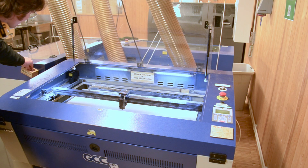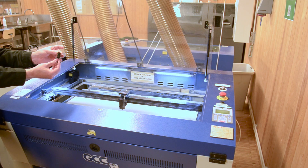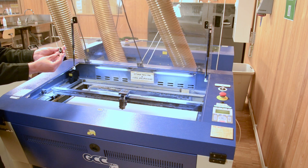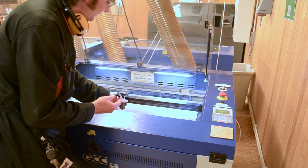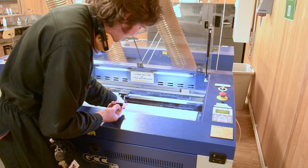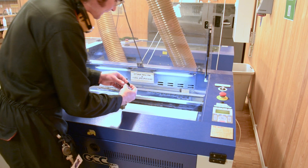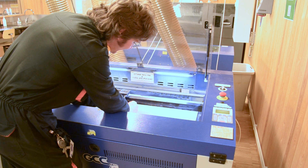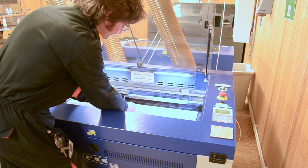Make sure that you fetch the focus pin. These are very valuable — they cost a lot to replace and are very susceptible to damage if dropped from holding height, so handle them carefully. Do not exert too much force when inserting it into the laser cutter head. There are two guidance pins and two corresponding guidance holes to ensure the eight connector pins are adequately seated. Hold it by the flap and gently position it using the guidance pins, then gently push it in.